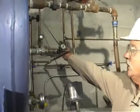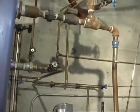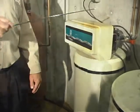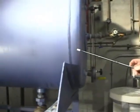Water supply enters here and we go through a water softener — sodium zeolite — where all the calcium and magnesium salts are converted to sodium salts, and then the water is fed into our feed water tank.